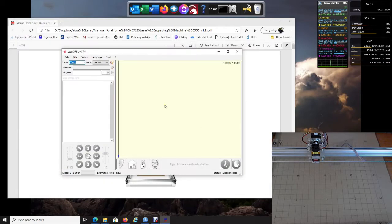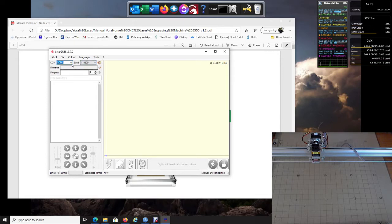Close Device Manager and come back to the software. Change the COM port to whatever yours is, then click the little Connect button. You probably heard the noise — you can tell it's connected because you get a message saying 'GRBL 1.1f,' and the buttons that were shaded out are now lit up. If you chose the wrong COM port, it will hang for a second, the message won't appear, and the buttons stay shaded — that's a telltale sign you picked the wrong port.